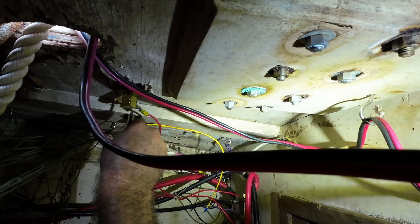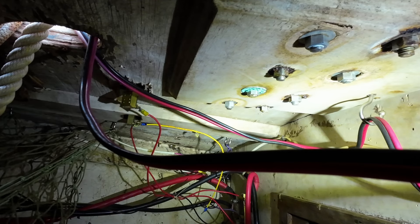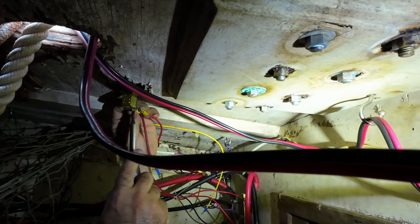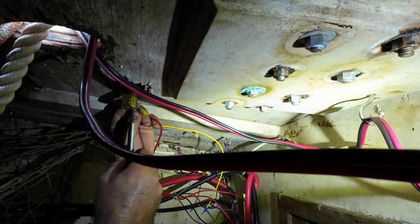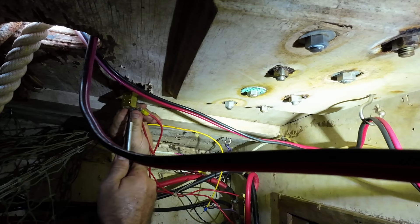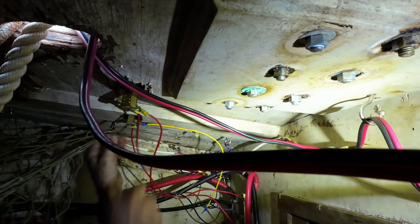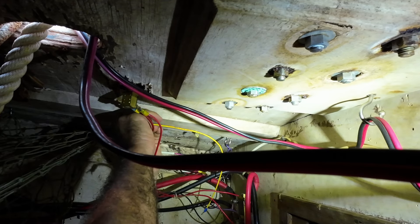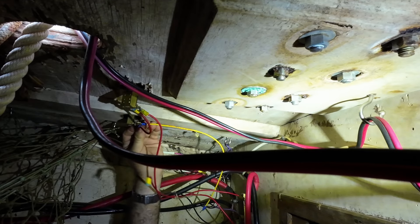The big point is it works really crazy well. The only thing that fails is the plugs on the solar panel. For this installation with these good wires I put regular extension cord ends on the wires. Very often I just get a cheap zip wire type extension cord like you would use to extend the wire for your television, cut off the female end and hook that to the solar panel, and then I have the male end that plugs right in as necessary. I know it's going to seem strange, but I've tried so many things and this works a charm. Best of all, the only things that fail cost like $2 or $3 at any hardware store, and having a few in your equipment drawer as backups is not a big burden.